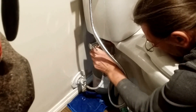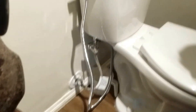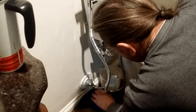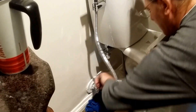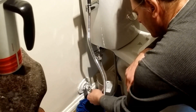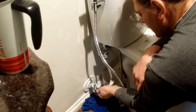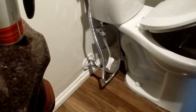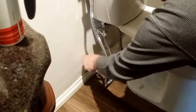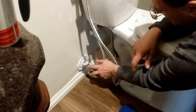The average person — as tight as you can tighten by hand. If you're a muscle man, don't push your luck. So now look at that — we have a dripping faucet. This is a compression nut; the threads have got tape on them which makes it difficult to screw things on correctly. So we're going to gently turn it on until the line doesn't turn easily — it should turn a little bit, but not easily. That should actually solve our leak issue and we should be able to turn the water on where the toilet will fill. If you had a problem with this stem leaking you might turn this another quarter turn — not around the stem. I'd like to give you a little troubleshooting advice at the same time.